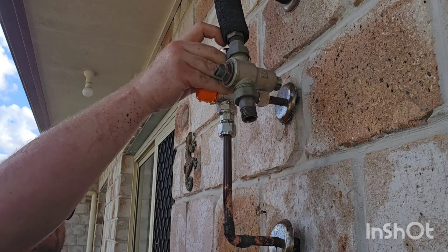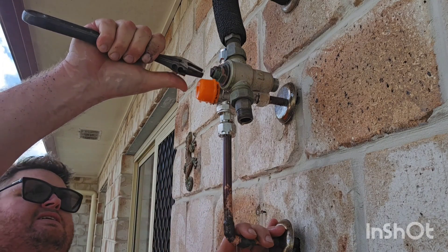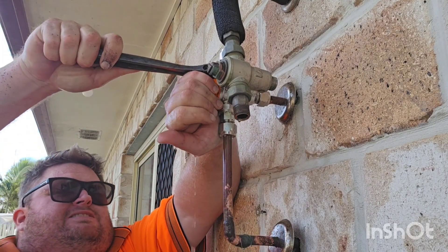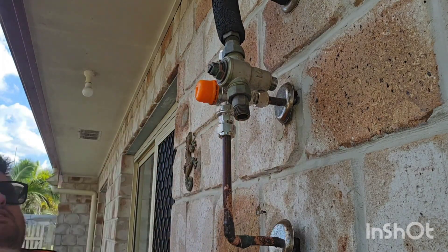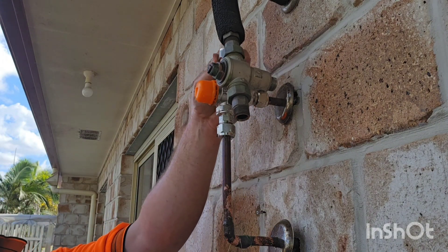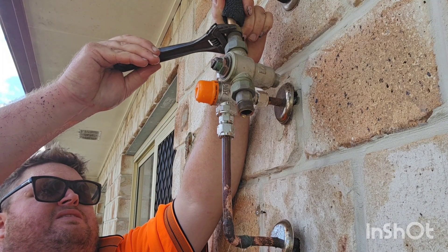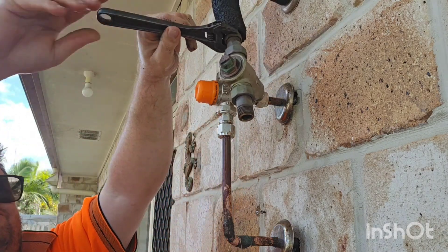It's very important to make sure that you don't have 65 degrees coming out in the bathrooms, because in all honesty that's very, very hot — it actually takes three seconds to get third-degree burns at 65 degrees. At 50 degrees it actually takes 10 minutes to get third-degree burns. I know some people really like their hot showers, but there's no way you would be able to stand under a shower at 50 degrees — it feels like you're on fire, absolutely scalding hot.